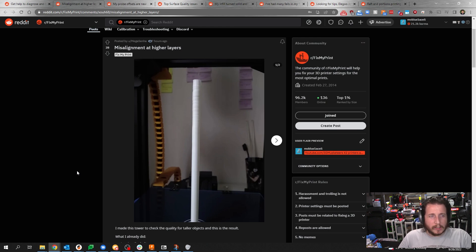It is just a part of the beast. You could go to a rigid bed, a ball screw driven Y-axis, X-axis, and Z-axis, and you'll probably get most of it out. But if you're going to go through all that work, you might as well just get a CoreXY style printer where the bed just goes down and your gantry moves on an XY plane — that will traditionally get you better results than a bed slinger. So if you're trying to do tall, thin parts, don't use a bed slinger. You can also look at drastically reducing your speeds as you get higher up, but you're really just fighting a losing battle.